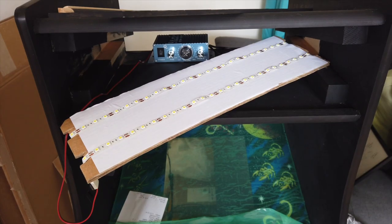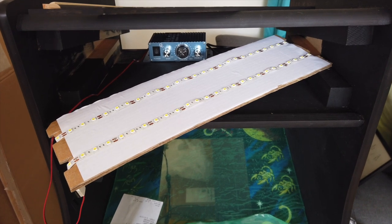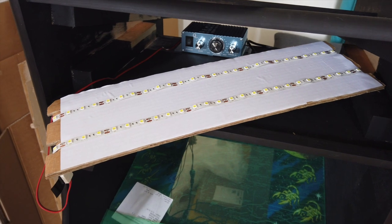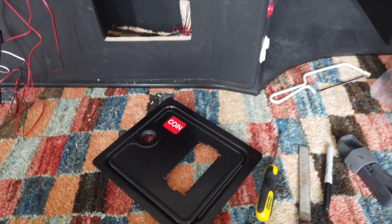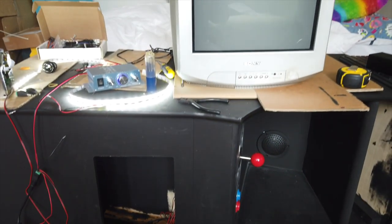For me, that was to power the coin mechanism and also some white LED lights to backlight the marquee — the name of the arcade machine — which was another thing I hadn't given a great deal of thought. You can see a test here where I wired it all up: the coin mechanism, the LED lights for the marquee display, and the amplifier driving the speakers. I noticed there's quite a lot of background hiss. I tried changing the wiring, I tried powering the amplifier without powering anything else — it works fine but there's room for improvement. So if you're planning an arcade build, put some extra thought into choosing loudspeakers and an amplifier you're satisfied with.